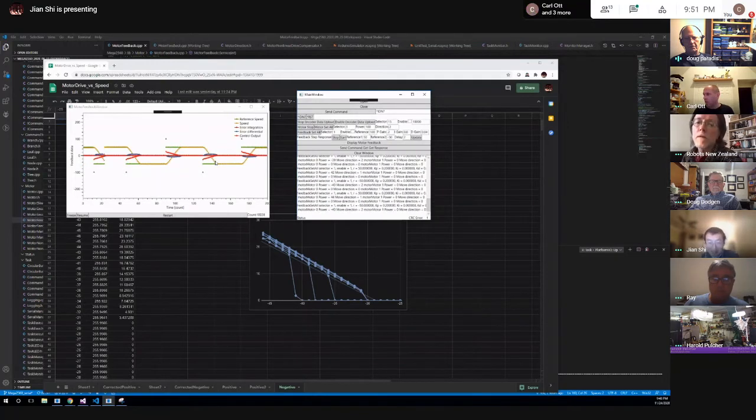Well, that's what I'm saying. When you turn with four wheels, you're going to skid. If you assume that the position of rotation is midway between the two wheels on the right and left side, and you draw a line there, which is probably a rectangular shape robot and not a square one, it'll be halfway between the two axles and in the center of the wheelbase. Do you follow me? Yeah.